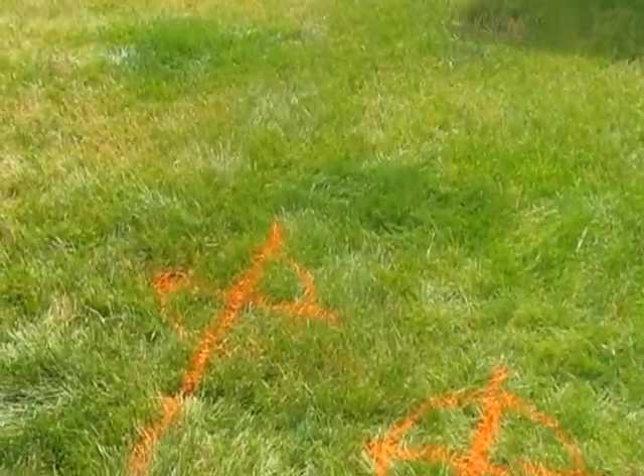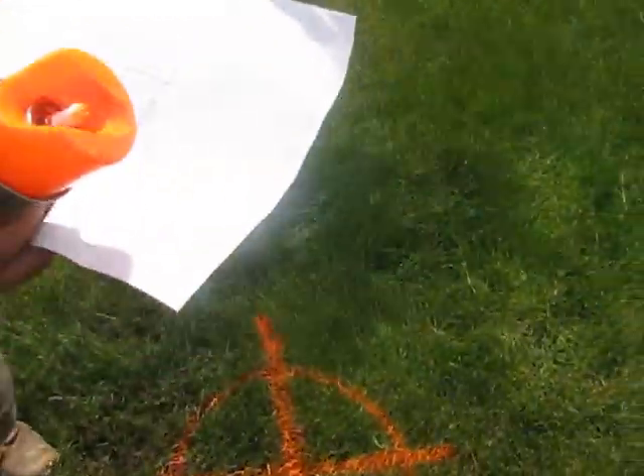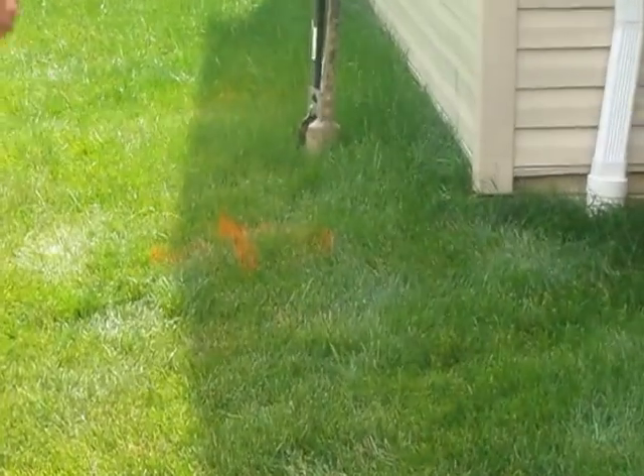The second beam — I see there's no need to really have the beams run past each other. The second beam, same thing. I pull out from the house my 12 feet, have a straight point from this section of the house. And again, keep everything symmetrical — one foot in and one foot in.